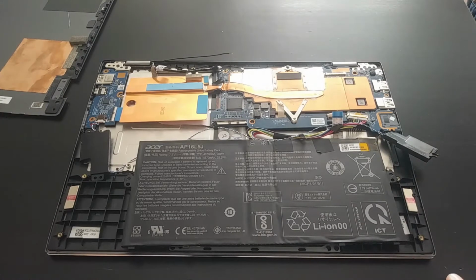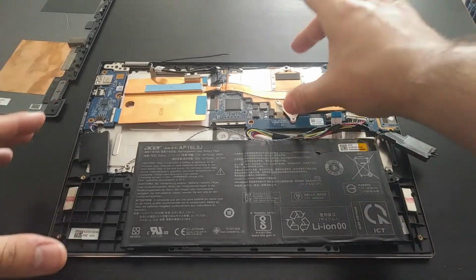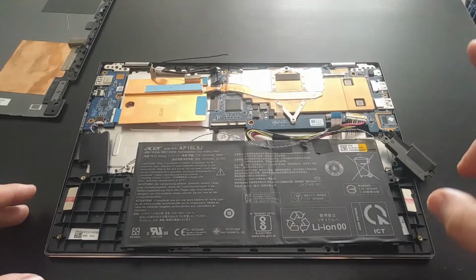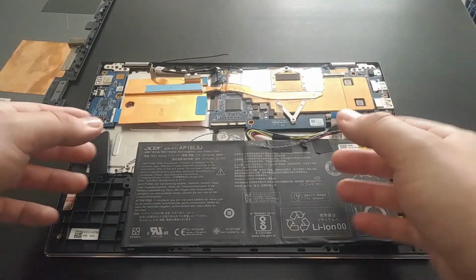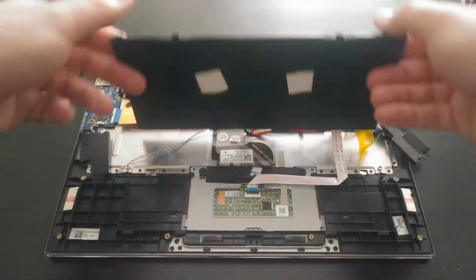It's not the best cooling solution when you build something that's made out of plastic and you have the components so close together. So one of the troubles I had to overcome was basically creating a way that would allow the battery and the motherboard to remain cool while still remaining in such close proximity, again, overlying each other.